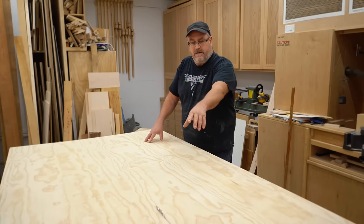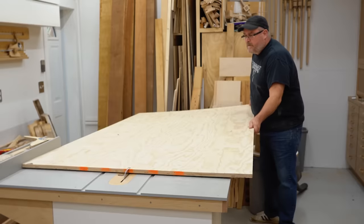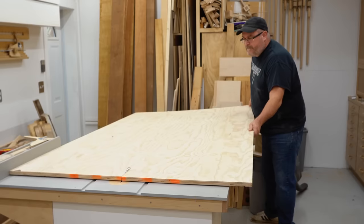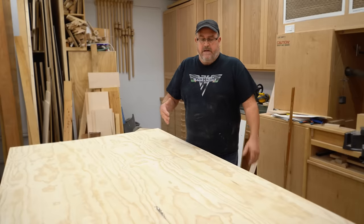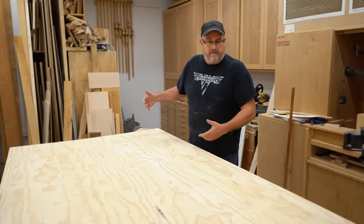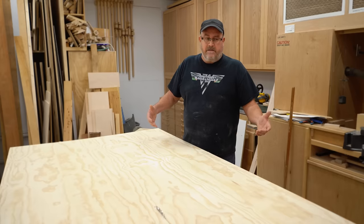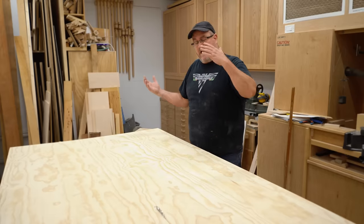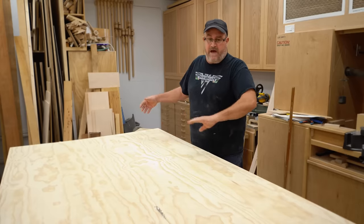I had a little difficulty at the beginning of the cut — something on the bottom of the sheet got snagged, so I had to wiggle it around. There are different ways to deal with that. The way I did it was to just push it through until it broke free. Since I knew this cut wasn't going to be perfect anyway, a slight imperfection was okay. Another way is to back it out, but doing that with the saw running could cause a kickback problem — especially with a smaller piece. The safest option is to set the sheet down so it lifts up off the blade.